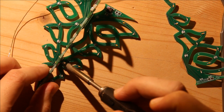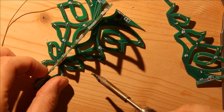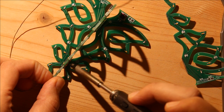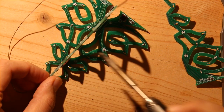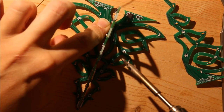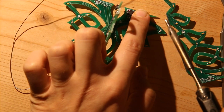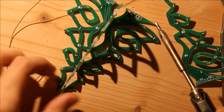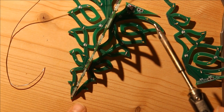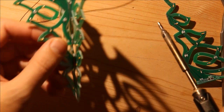And these connections are actually ground and basically positive and negative voltage or whatever. Each side of the power source will be connected. These two connections, I believe, are ground, and this one is the positive voltage. And that's how you only need one power source to power everybody. And then one side of these will be the positive side for the LED tree topper, and the other side will be negative if you chose to populate two of the resistors.